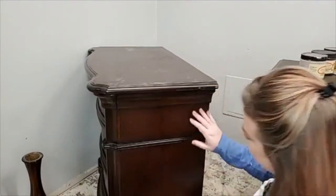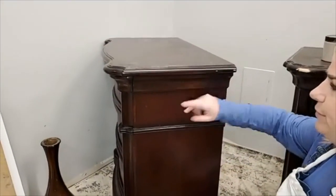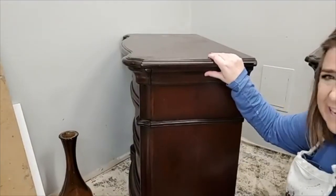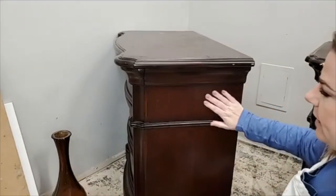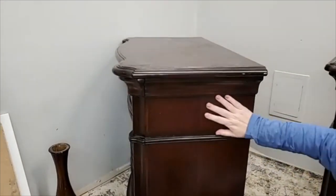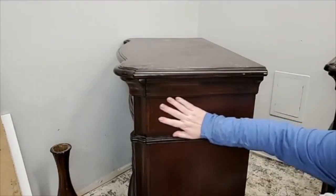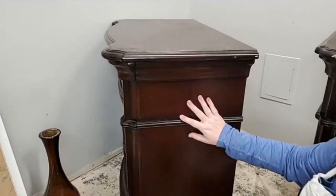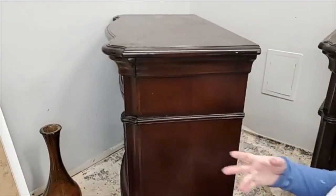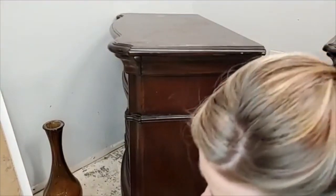Once you've cleaned and rinsed your piece, it's got this glossy finish. A lot of people like to use Slick Stick on a surface like this — that would be an option. Some people just don't like scuff sanding and that's okay. On these pieces, if I wanted to use Slick Stick, it would take about an hour to apply it to both, plus I'd want to give that 24 hours of dry time. So scuff sanding lets me paint these tonight instead.